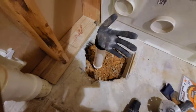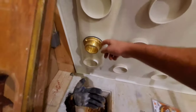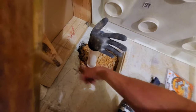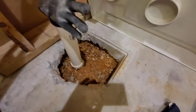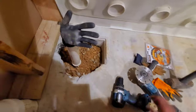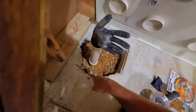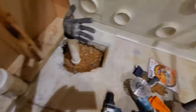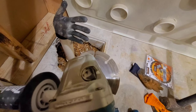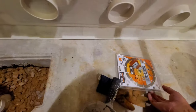Here's how I did it. I laid this base down after I got my tub and shower enclosure pulled out. I took a pencil and drew a line for how far this pipe had to come over — in a 30-inch enclosure it was about three inches in this direction. Then I took a masonry bit and drilled holes in a pattern that would incorporate around that line I drew, and then I took this cutting wheel. It wasn't very deep, so I had to make two cuts.